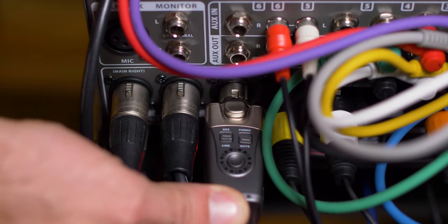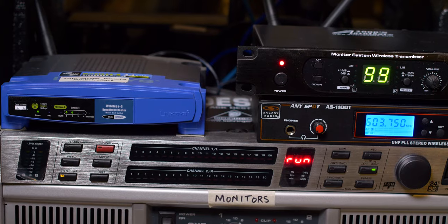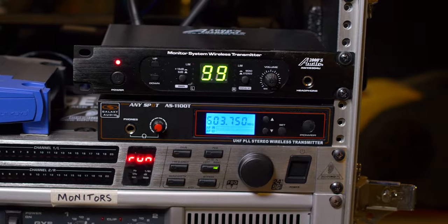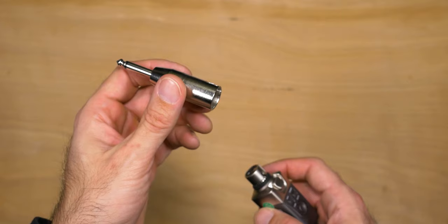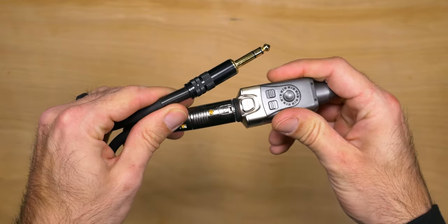Starting with the transmitter, this thing is small — so small, in fact, that it plugs right into your mixer or your audio interface. This form factor is absolutely awesome. I don't know of any other manufacturers that have a form factor this small. They'll typically fit into a one-unit rack space and be about half or one-third of the width. The unit has a female XLR connector, so it'll fit into most mixers or audio interfaces. It does come with an XLR to quarter-inch tip sleeve converter if you want to plug into an unbalanced quarter-inch connection. If you have a balanced quarter-inch connection, you'll want to get a short XLR male to quarter-inch TRS cable.